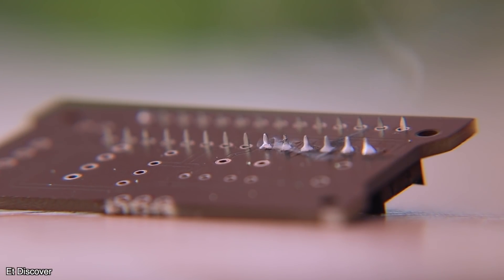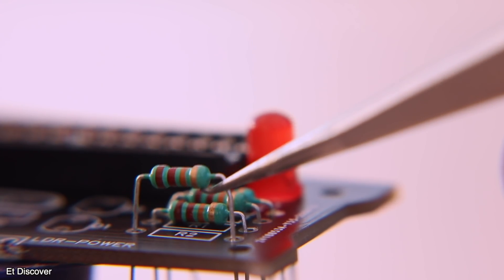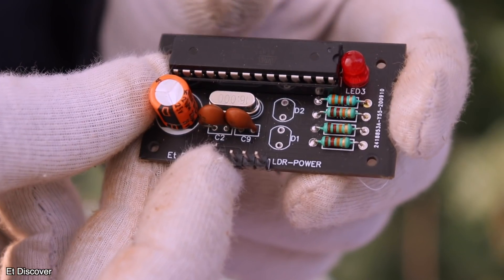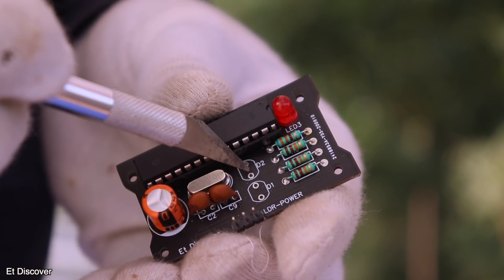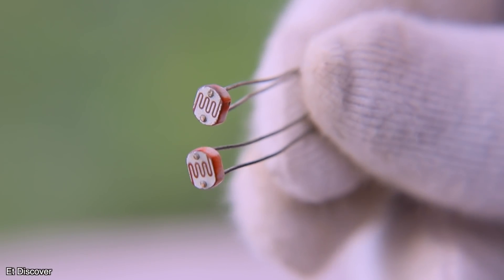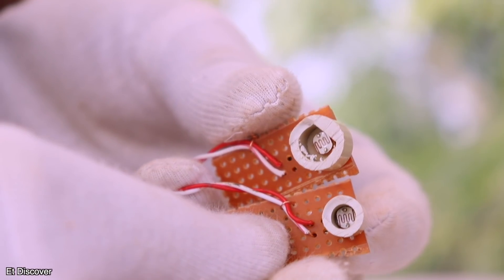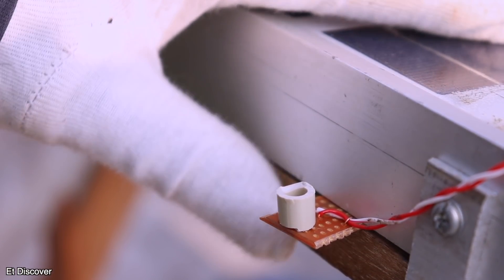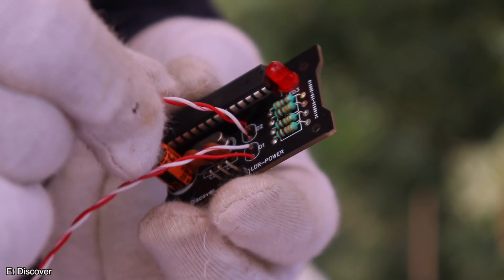You can also use an Arduino if you want — this is very easy to make. The circuit diagram you will find in the description box as always. And you can see my PCB is done. The only part left is that I must use an LDR sensor here to follow the sun, so I will use two sensors which I converted to a dot board. I will attach these sensors at both ends of the solar panel, and then attach them to my PCB.